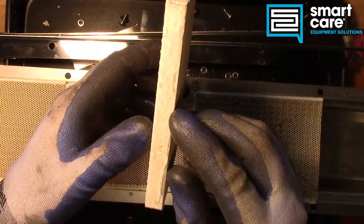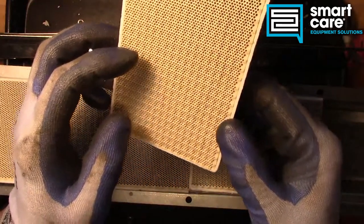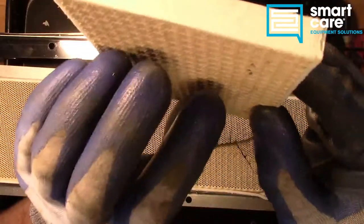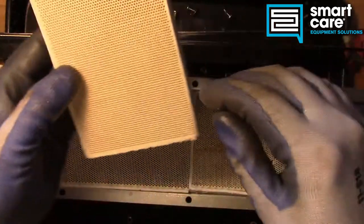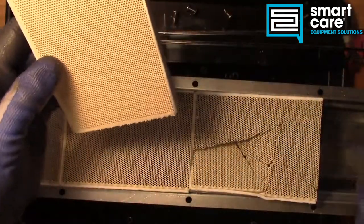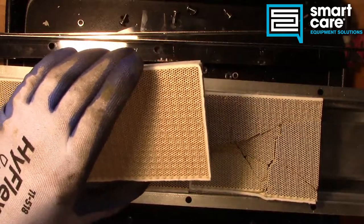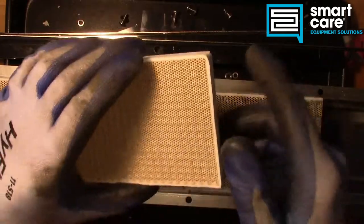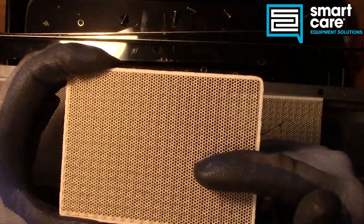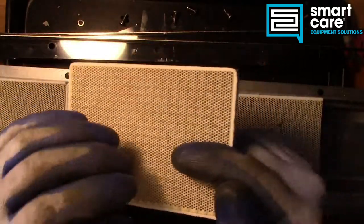You can see the tile is a little less than a half an inch thick, and it's just a very fine grid of holes on both surfaces. There's a bit more texture to the flame front side — it's got some waviness to it — but the back side is pretty much perfectly flat. You can see how tight the fit of this gasketing was, and that's really critical. If there's a weak seal between the gasket and the body of the burner, you'll get a flame that rolls in around the edge, losing pressure on the back of the rest of the burner, so you'll get a hot spot.